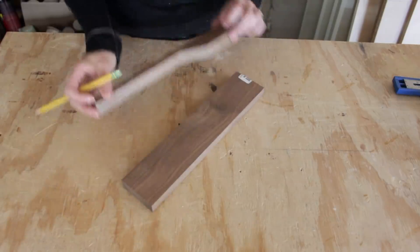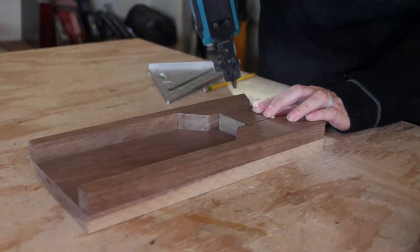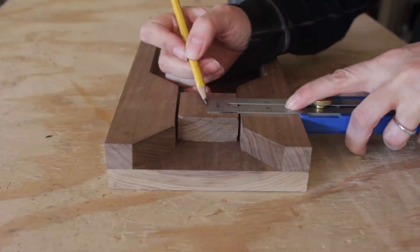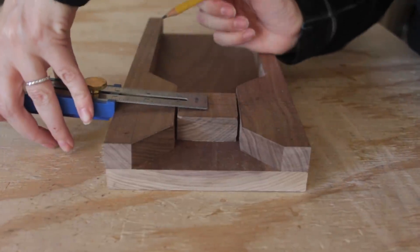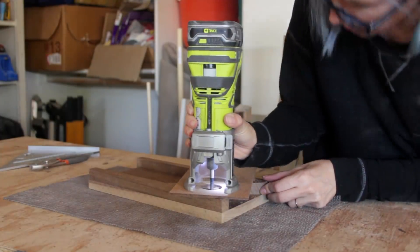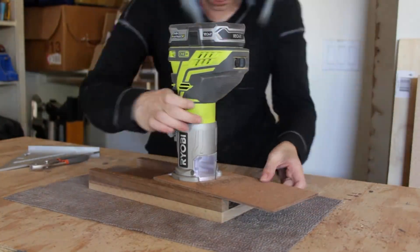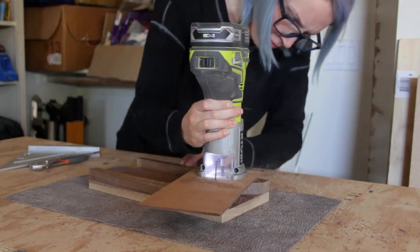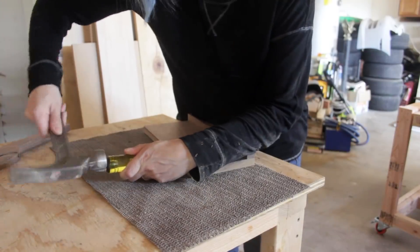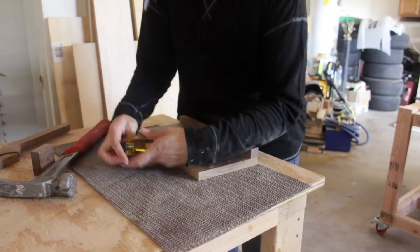The candy is distributed from a circle in the center of the two side boards that spins around. I used a piece of scrap to make cutting the circle easier. I temporarily tacked the sides and a scrap block to the 1x5 backer board using a 23-gauge pin nailer. I found the center between the sides, then used a DIY circle jig and a palm router to cut out the circle. Remember to work slowly and take multiple shallow passes. I stopped just before cutting through the circle so I wouldn't damage the backer board, then carefully used a chisel to pry the pieces loose.